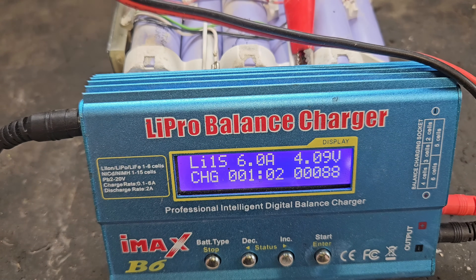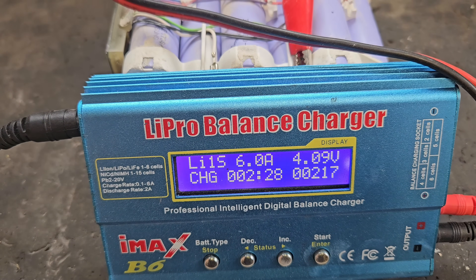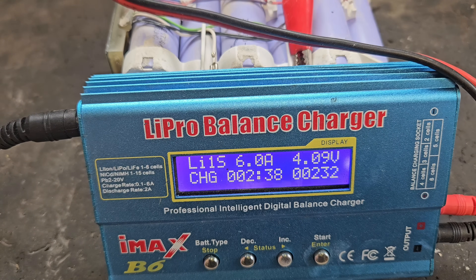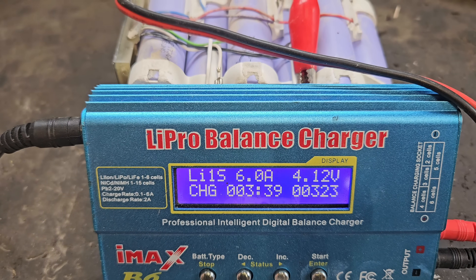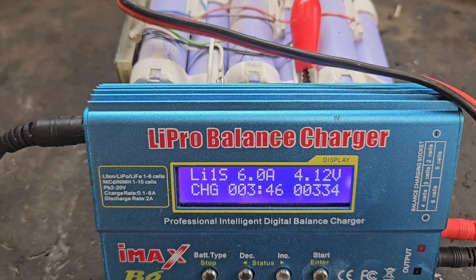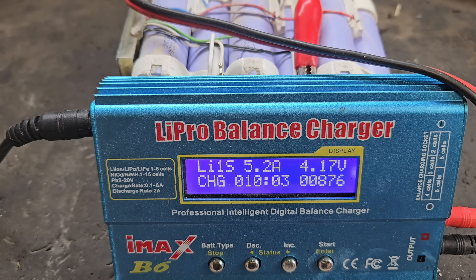I'll leave that charging and come back when it's done. For those gentlemen in the comments who say 'put a wire from the positive terminal of another battery and a wire from the negative terminal' — that will not correct cell imbalance. It will not. There's more chance of actually damaging the cells than correcting this issue. This balance charger method is the only answer, and it's a very safe method because it won't overheat the cells — it's a very gentle way of bringing them back.